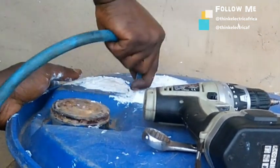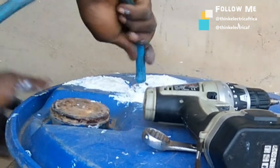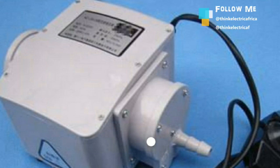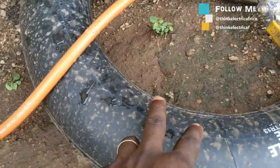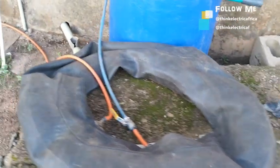This design will not allow you to connect the gas hose from the digester directly to your burner, as it will require some form of pressure — unless you want to use a gas pump, which requires another energy source. I advise you use a gas bag. What I personally find affordable is a tire tube. I had a small 16-inch rim tube which gets used up quickly, and I had to upgrade to a truck tube, big enough to start and finish a meal without running out.